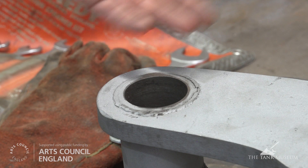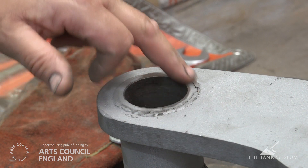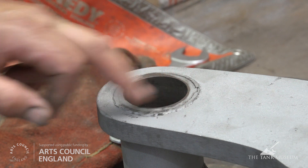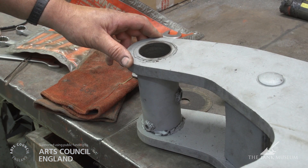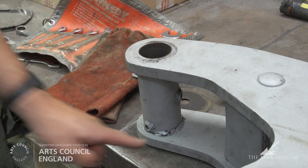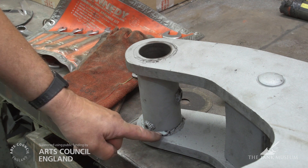This is one of the Matilda suspension levers which, after shot-blasting, we've now discovered some cracks in the actual construction, which we'll have to rectify before we put the new bushes in. These welds have actually cracked right the way through - they could be stress cracking, or more likely when it's had a bit of a pounding going cross-country, something has given away.